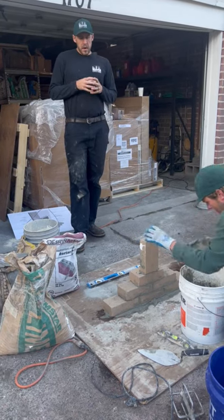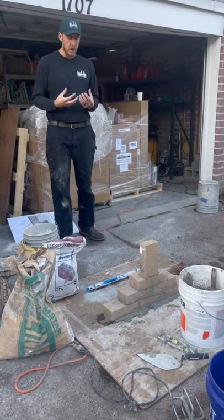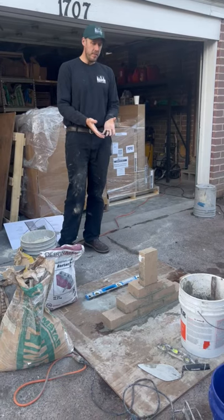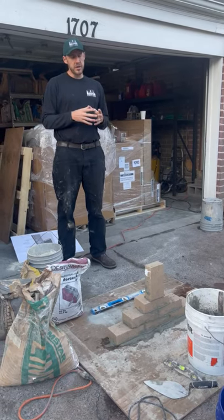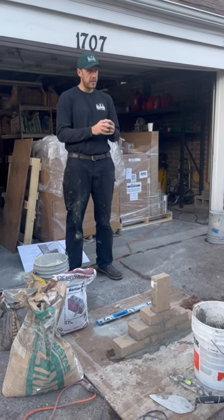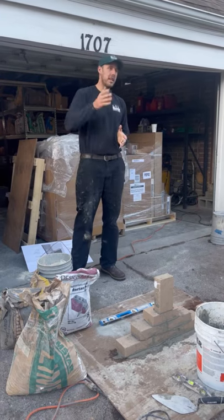You have to understand that if we're doing this work in the winter time, the moisture inside is going to have a harder time expressing. Masonry is like a sponge. When there's mortar in it, it needs a warmer temperature to literally exhale the water that was used to build it. So when I tell them to break it in, it's short duration, very quick kindling fires. What we want is to very lightly expand and contract, expand and contract, expand and contract. Not huge expansion right when it's done, because if we expand it too much and there's still some moisture inside the material, it'll crack.